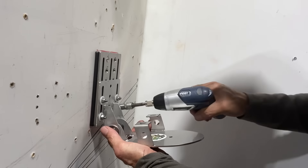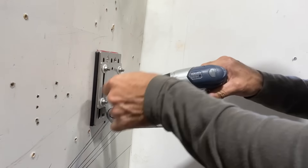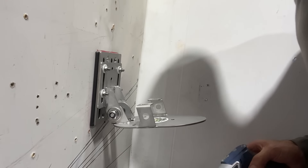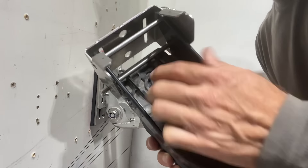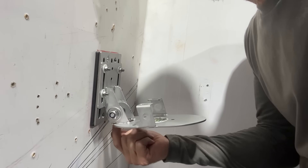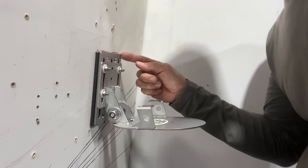If it's too deep in the water, lift it up 10 millimeters — we'll just exaggerate this — done. You've got your height adjustment there. This particular mount is easy to change over if you have the original one already. All you do is take the transducer off and then just cut through the plastic here — that'll come off and it'll easily replace here because the back of this mount has a slot for the cable to go through.